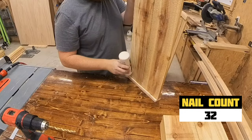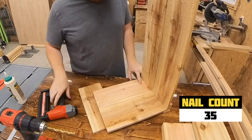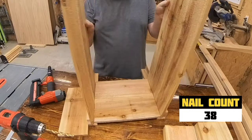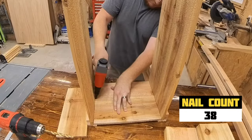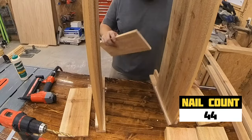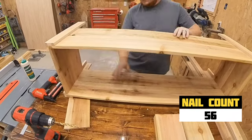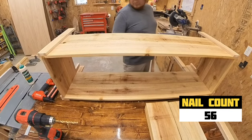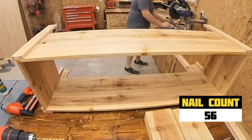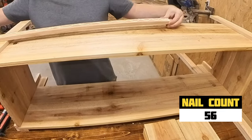This balancing act can get a little tricky. If you have a wall or something to prop the board up onto, that's a good option as well. Apply some glue to the top lip and align the short boards with the top of the box. I have had a few boxes where the pickets were not the same width and one side was longer than the other, but this is less noticeable with how the legs are wrapped around. Flip it over and repeat. If you have a board that is cupped pretty bad, most of the glue is going to leak out, so try to target the area where the boards will make contact. I didn't subtract the short sides' thickness from the ledger board, so the ledger needs 2 inches trimmed off. In the cut diagram I left them the same length as the long sides — if they are too long, trim them down a bit, and if they are too short, it's okay that they don't butt up against the short sides.